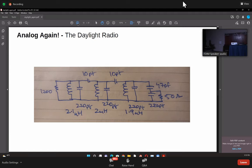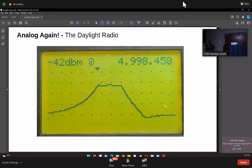Each one of them is a fairly simple, just a division or a multiplication, but you just keep applying these iteratively and you get your bandpass filter. Right, so this is how you do the bandpass filters. Very often, when you're trying to do a radio, you just put coils and capacitors and keep fiddling around with these values. At times you get them right, at times you don't get them right. But if you just follow this simple algorithm, you will always get your bandwidth correctly.